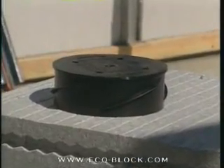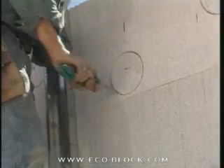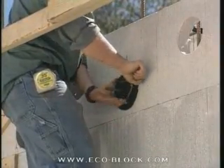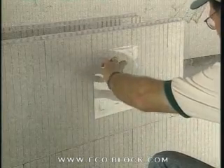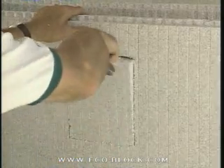This commercial ICF ledger mounting system uses plastic inserts that screw into the block. Holes are cut with a saw, and the inserts are mounted in the holes with a special tool. This system makes its own marks for cutting out the foam, and being clear allows for visual inspection during placement. The bracket is held in place and tapped to mark the foam for cutting, the foam is then cut out, and the bracket is held in place by its corner lugs and zip tied tightly to short pieces of rebar on the inside of the block.